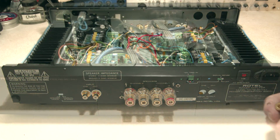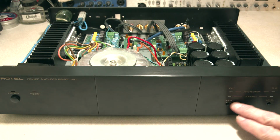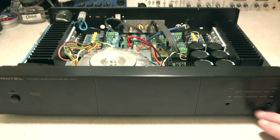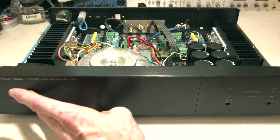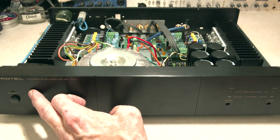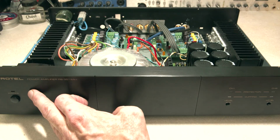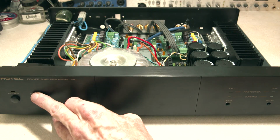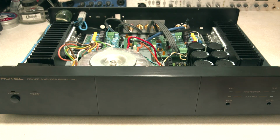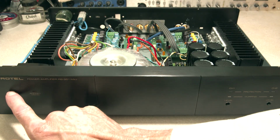So, of course, there are some holes in the back that are now open that aren't used, and there are some features here in the front that aren't used any longer. There's no longer level controls and lights and all that stuff. One of the things I failed to do was to reutilize the LED light that was here. I didn't measure the voltage coming off the power supply to this lamp before I disassembled it, so I could not tell what the voltage was that drives these little lights. So that made using those pretty impossible. I did order some bulbs, and I'll just maybe drill a hole or something and mount the little bulb here.